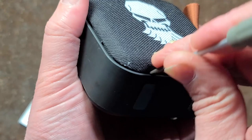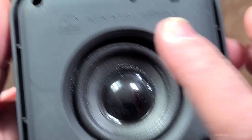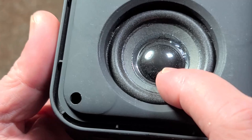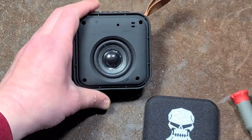The front cover — I noticed you can pry it off. So we're going to tear this thing down and just see how bad it really is inside. I suspect this is a one and a half, perhaps two watts peak for the speaker. It's not silk screened; it almost is like a bleached logo. It's D-A-X-I-A-N-G — Daxiang speaker, which is like a real backwaters Chinese company. This is a standard cone driver with a polyurethane foam surround. That's going to deteriorate, especially in the sun, if it's supposed to be used outdoors — but it's not waterproof.